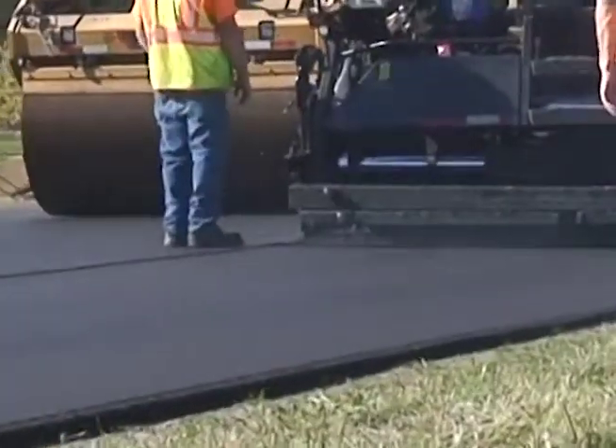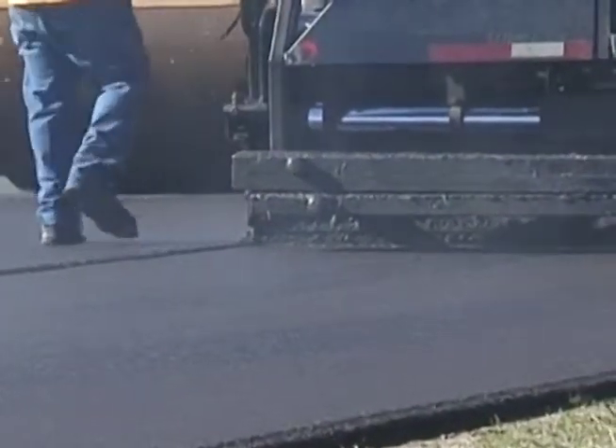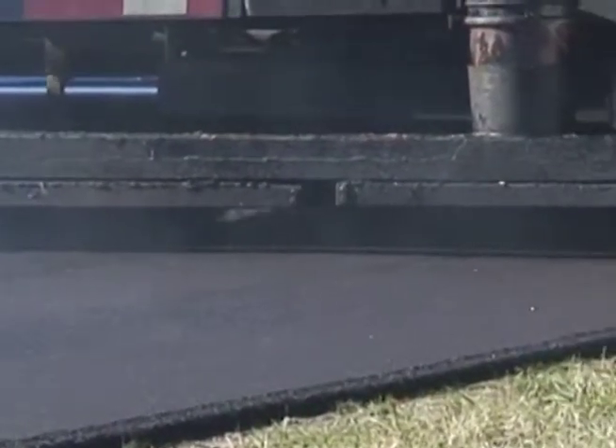It's a one-inch inner layer, and the hope is that after several years we see delayed cracking in the surface layer. Today this mix looks great. We'll know more when we get the laboratory test results, but just by looking at it, it looks good.